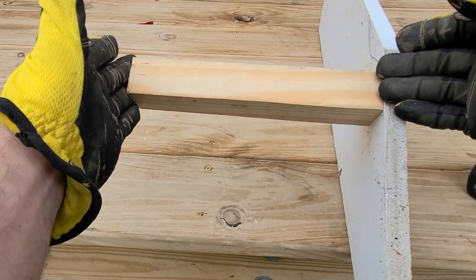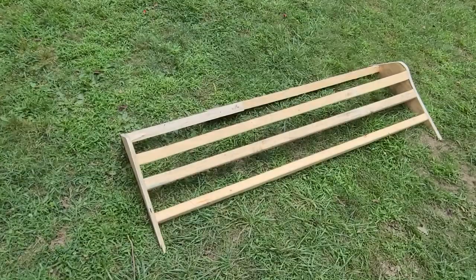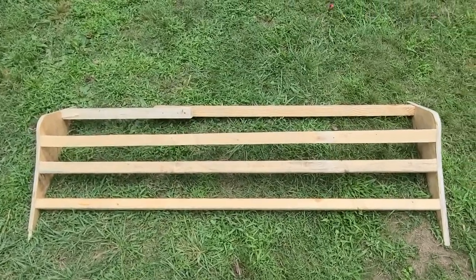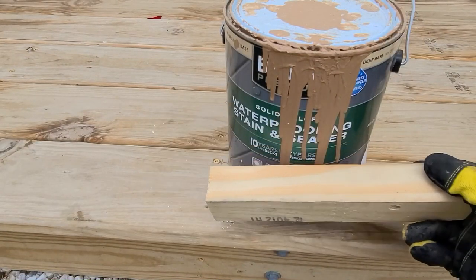Put on your other side plate. I spaced my stringers about 10 inches apart, which worked great for me — you can experiment and see what works for you. There you go, here's the basic skeleton frame of a ramp. We'll sheathe that and I've been putting astroturf over top of these.